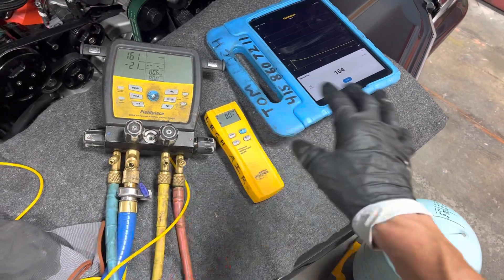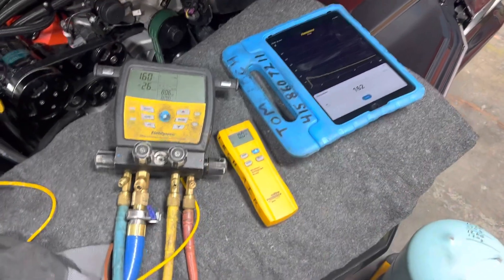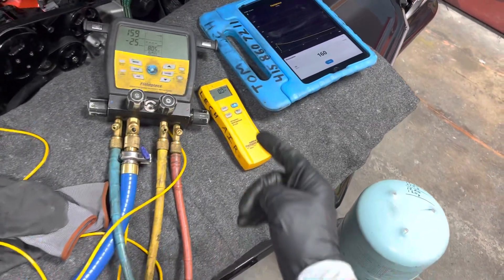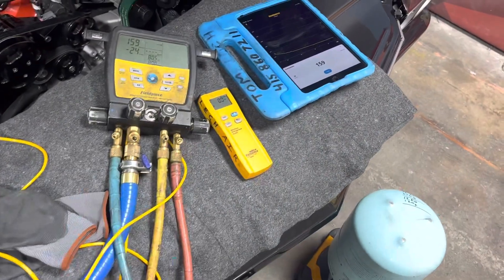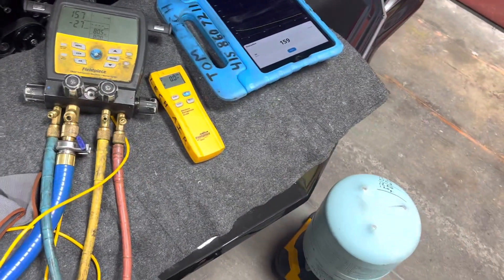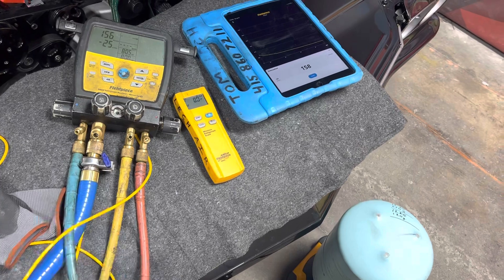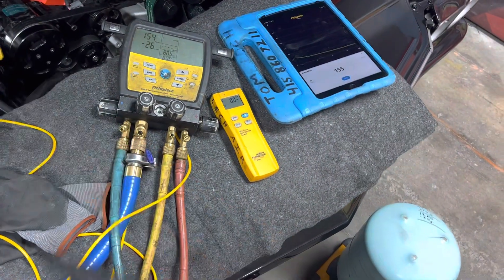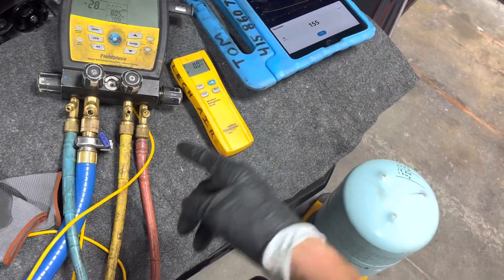In commercial refrigeration, that would be a failure. You might even get ice building up on your expansion valve on the inside, blocking your refrigerant flow on low temperature refrigeration. We're at comfort level, high temperature air conditioning for comfort, so that's a different story. But you still make acids in the oil and break down the ester oil, the POE oil that's inside the system.